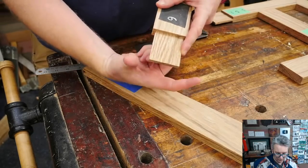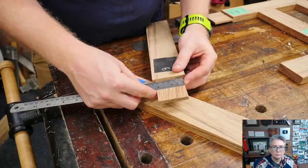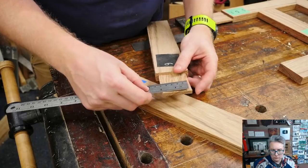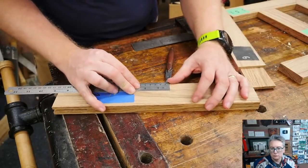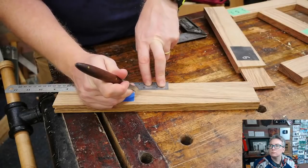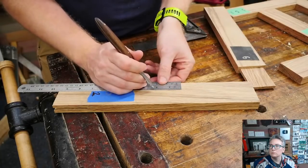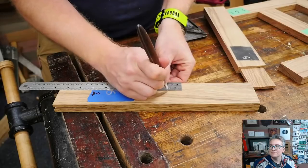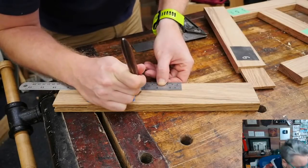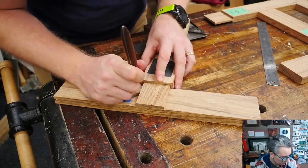My tenon — I just cut off a little on either side to give a shoulder all the way around, so this tenon is two and a sixteenth inches. I'm going to roughly lay out some marks to see where I want it. Half of two and a sixteenth is one and a thirty-second, so I'll put a mark right there and another one up that way, and theoretically the tenon should sit into those two marks.